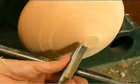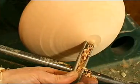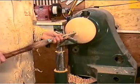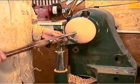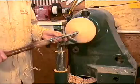Rest height is less important. I usually have it slightly above centre on the outside and a bit below when inside the bowl. So long as the gouge can reach the bit you want to cut, it is purely a matter of convenience. With the tool cutting on the ridge as here, whether the handle is up here or down here, the bevel is still on behind the cut.